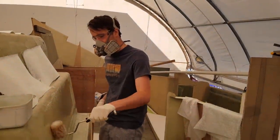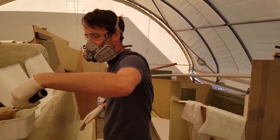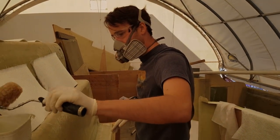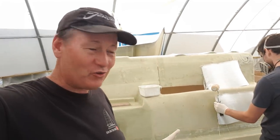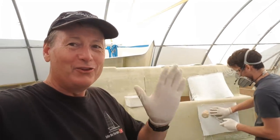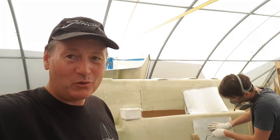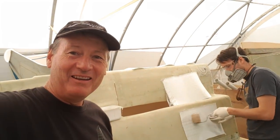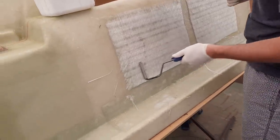But fiberglass fails quicker and more catastrophically than steel — it doesn't have any elongation so you can't see it failing. That means people can die. Sam asked me why we were reinforcing these engine modules, and it's not about strength — this is purely a decorative piece. It's all about not having the thing vibrating on the hull side when you're driving along. Vibration is not a man's best friend.